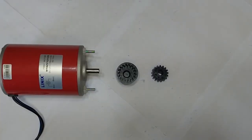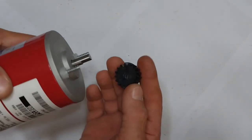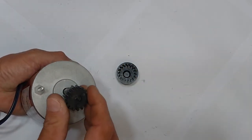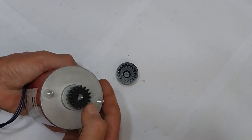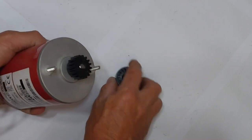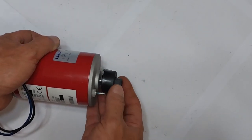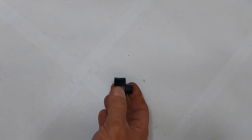It's now time to fit the electrical motor. It has a coupling system which slides over the half-moon on the electric motor, just like that. Then you have the other half that is pressed down into the worm shaft.